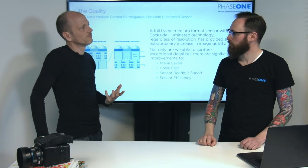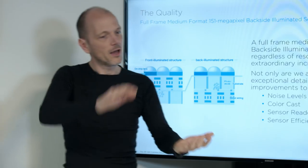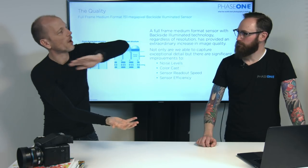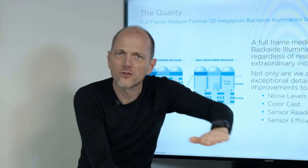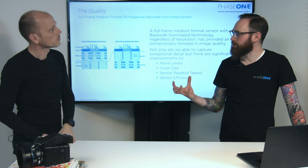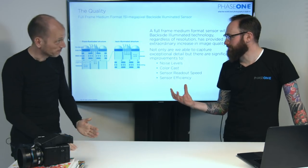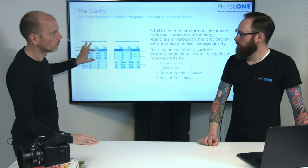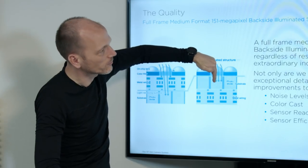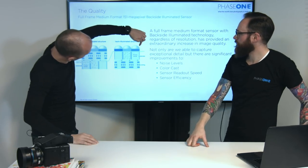One very simple solution — which in principle sounds simple but manufacturing-wise is a miracle — is that after making the pixel and all the electronics, we flip over the entire sensor and grind away the silicon from the back side until we get down to the pixels themselves. Then we can put the color filters directly on top of the pixels and then the microlenses. This is the essence of backside illumination: we illuminate from the back side of the sensor, which is now the front. So the light does not have to pass through the layer of electronics and wiring, going straight from the color filter directly into the pixel. Even if that light comes in at an angle, there's no way for it to jump over into the next pixel.